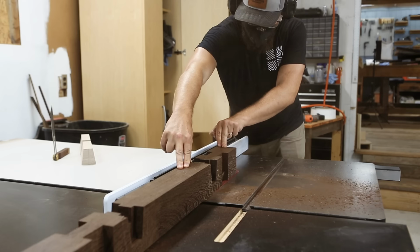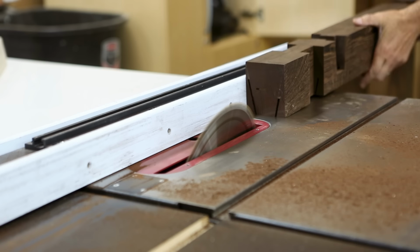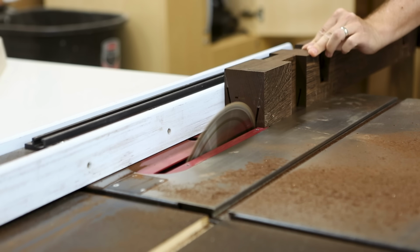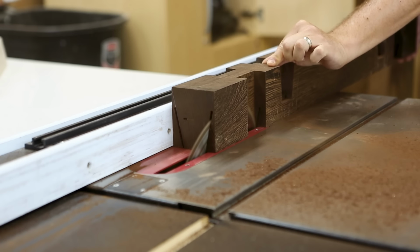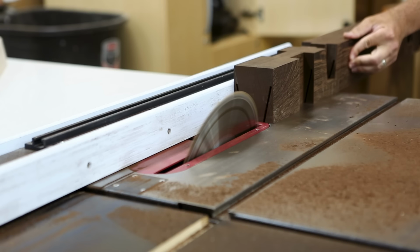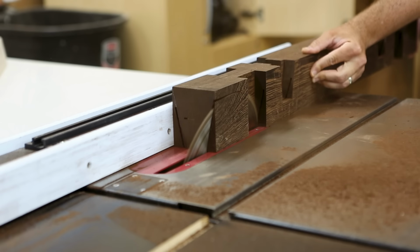I took an approach I've used before to perform resaw operations on a table saw, where you start with a blade low and make multiple passes, raising the blade between cuts. It honestly worked really well, even with the blade set at a bevel. It let me make cuts on both sides while keeping a square corner supporting the ride along the fence. That is, until the last pass.